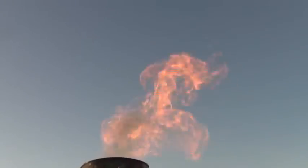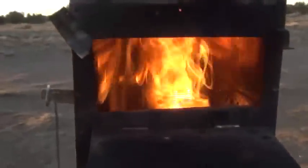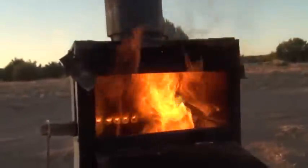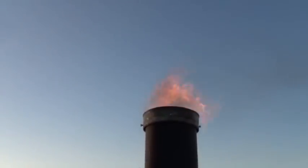There's still a lot of energy coming out the pipe that we can burn and use. So the next stove will be adapted to use this energy — heating hot water and running a generator. That's about an eight-foot flame coming out of here. One of the limitations so far is definitely not capturing all the heat in the syngas wood stove. I'm going to go ahead and open the door again and show you what's going on inside. We still have immense fire going on inside. For the little bit of wood I put in this stove, the amount of fire taking place is incredible — it's obviously a better way to make a wood stove than the typical design.